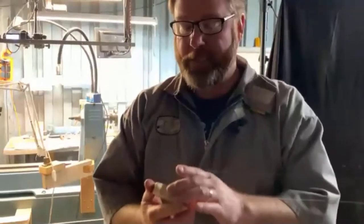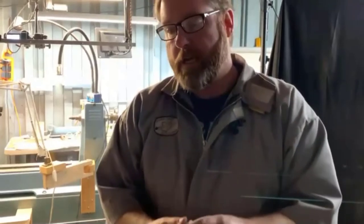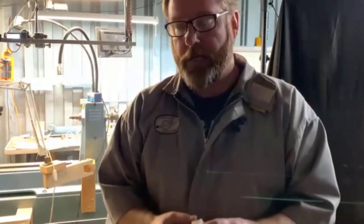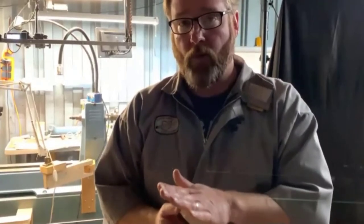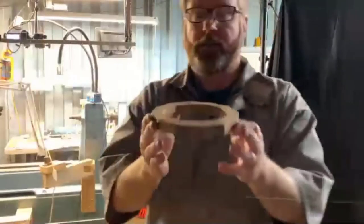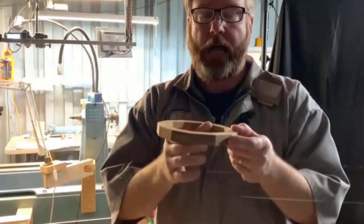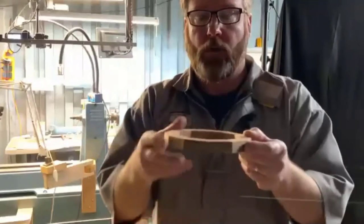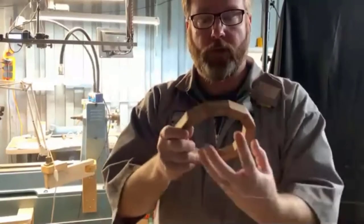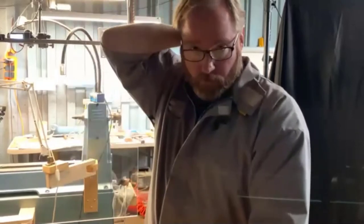Okay. So yes, that was, again, Ron, just what I was about to talk about. The reason I do a solid segmented base is because typically my bases are very small. If you see any of the professional wood turners, like Malcolm Tibbetts, for example, he talks about the need for either a solid wood, not a segmented, but a solid wood base, or a floating base, which means, to exaggerate it, say this is your ring layer number one. You would come in here and create a groove where you would then have a solid wood plate of some sort fitting in there that's loose to allow for the seasonal expansion and contraction of your ring, so you don't get that pinching action. But a lot of the pro turners mention that as long as your base is smaller than, say, 5 or 6 inches in diameter, you shouldn't really have an issue with that.